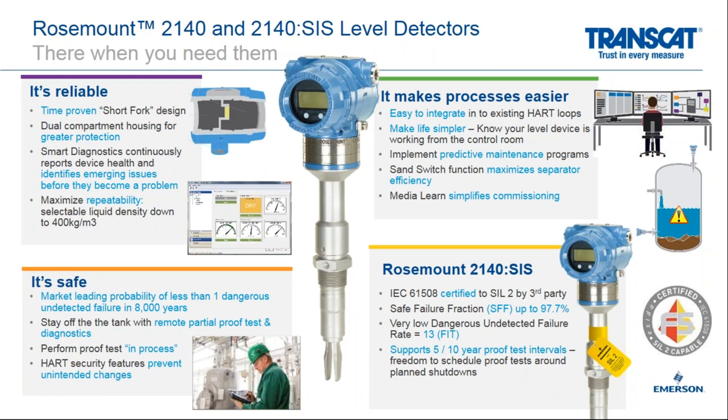And over time, the fork may corrode, or you may get coating, or there may be damage to the fork physically. Those frequencies will change. So if you have coating, the actual frequency of vibration will start to drop over time. It'll slowly degrade. And if you have your 4 to 20 milliamp mapped to a frequency range, your milliamp range will go down as well.